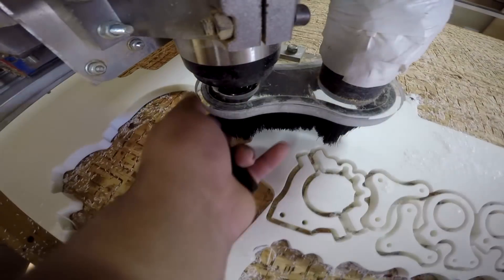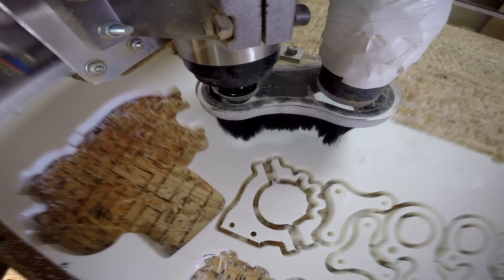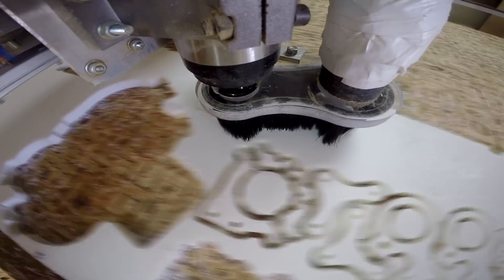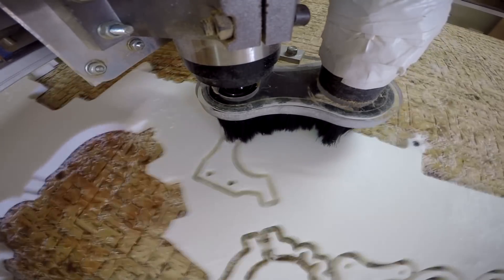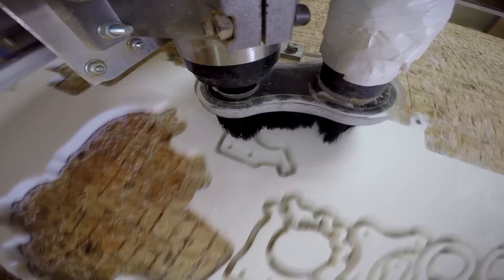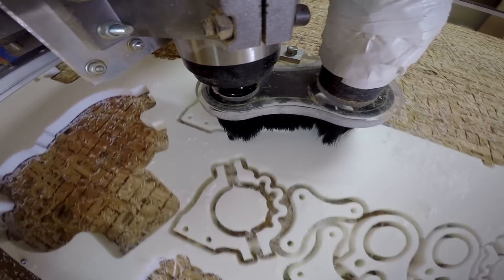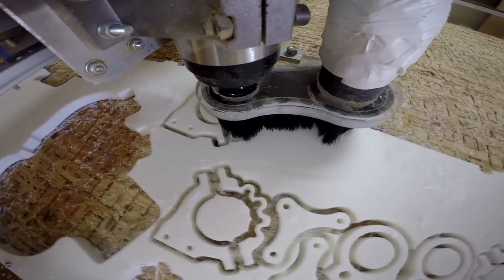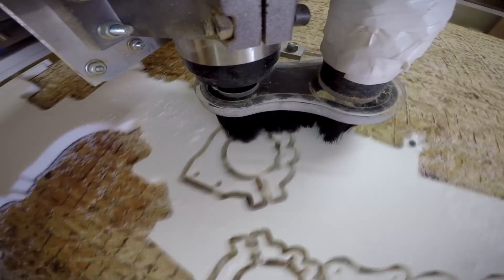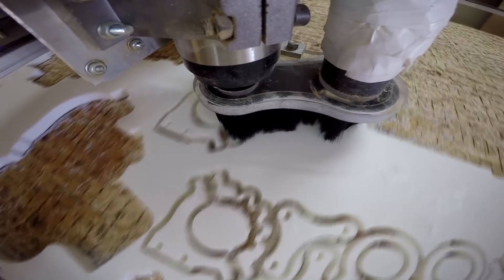Okay, so that's finished. Now he's going to run the other part that messed up at the beginning. The spindle is off — it's just positioning the end mill at the beginning of the scrap material, trying to utilize as much material as possible. Now it's pecking in the holes — these are just standard straight drill holes, exactly the same size as the end mill, which is a quarter inch. This is essentially the same process, just with more holding tabs added. We didn't have to modify the profile or the part at all, just added more support for the parts to hold in place while the machine finishes cutting.